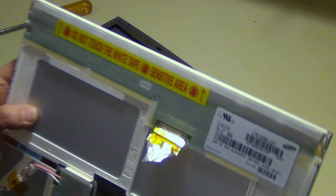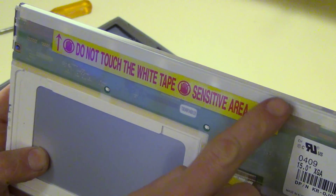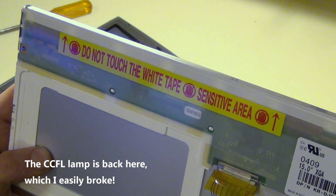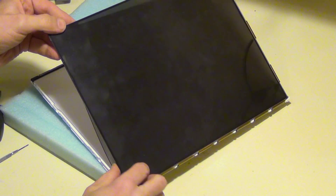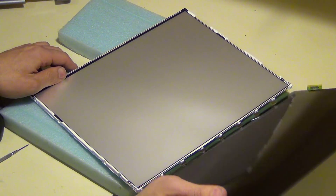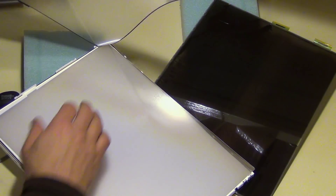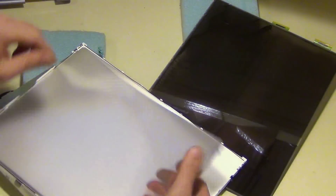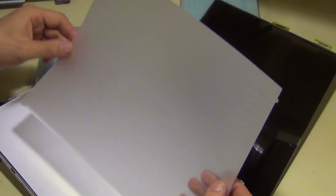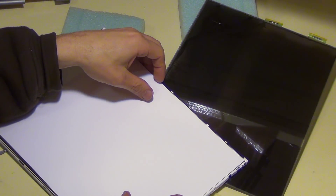There are a few other parts in the LCD panel assembly that I wanted to salvage. The LCD panel is made up from a few different layers of materials. The first is the actual glass liquid crystal display, which I quickly cracked since the frame was no longer protecting it. What I was really looking for was this diffusion film, which can be used to soften the light from the new light panel. There are also two polarization films, which are of little use to me, and a second bonus stronger diffusion film. There's also a thick white film, which I have a perfect use for in this project.